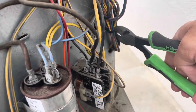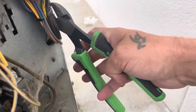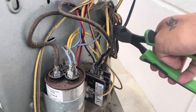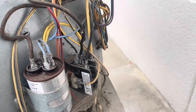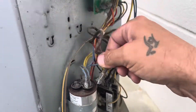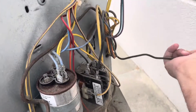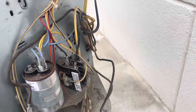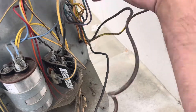There was a lot of wind noise and vehicle noise passing by on this one, so I figured I'd do a voiceover. We're just getting our zip ties cut off here so we can get those wires pulled and that motor out. So we got a wire on our capacitor — fan side of our capacitor — a wire on our load side of the contactor, and we're going to have a wire on the line side of our contactor too. So we're going to get all those pulled off.